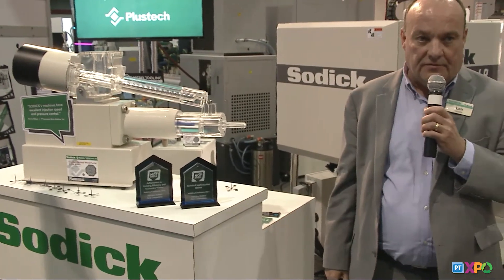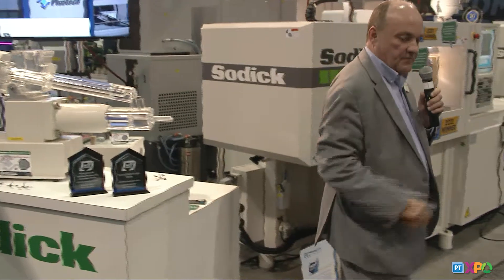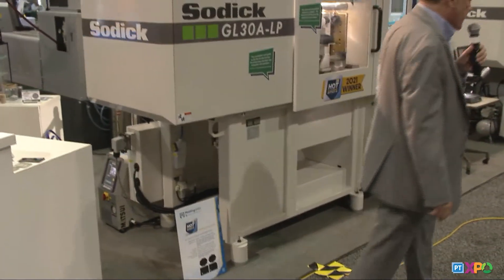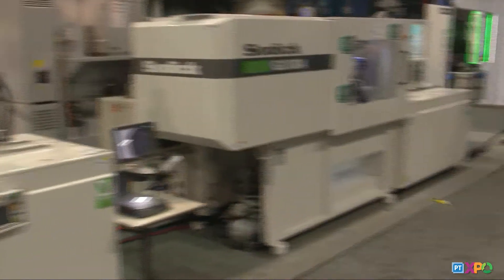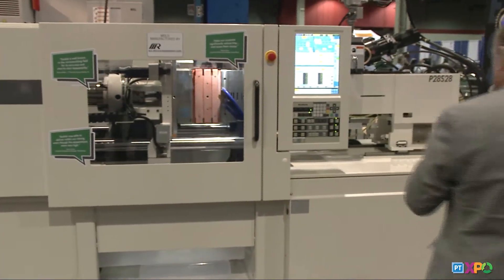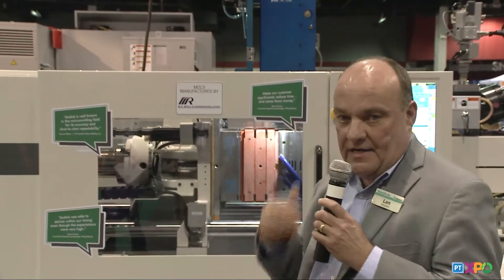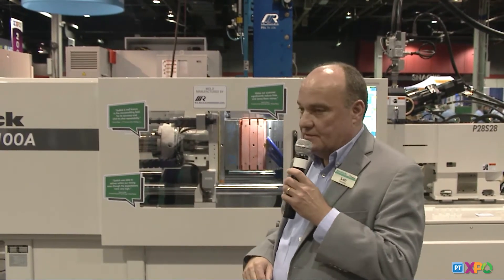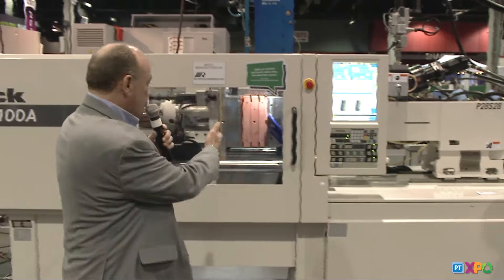Much less gas, much less shear developed with an extruder screw. And the plunger delivers an exact dose every single shot. If we move over to the second machine, we'll show you the LSR silicone — very low viscosity material. This is a 100-ton SODIC with the LSR package — basically the same machine but a different injection unit, because LSR is a little opposite: you have cold material going into a hot mold, and then it sets up that way. We're partnering with MR Mold, Rick Finney and Jerry Anderson. MR Mold developed the automation on top as well, which has an in-mold slitting device. Maybe Rick can explain what's going on with the mold build and the automation.